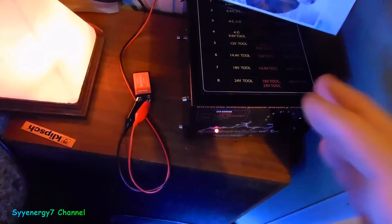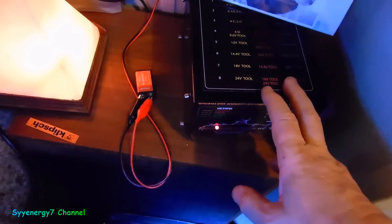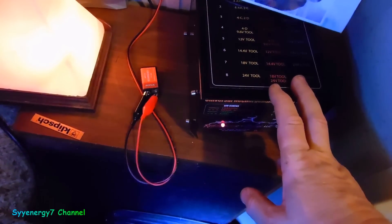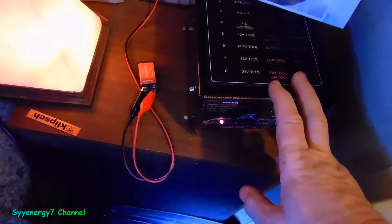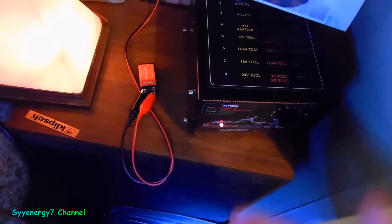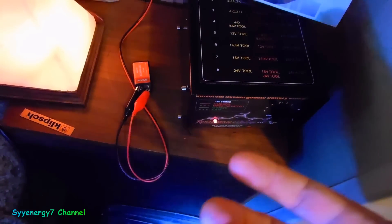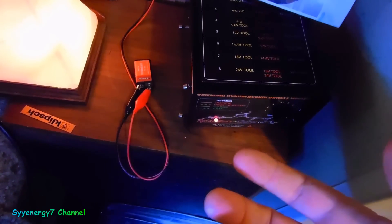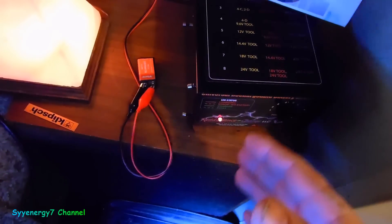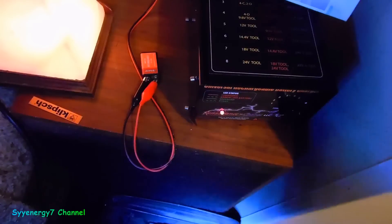If you see a battery that's got a shape like it's all curved like that and it doesn't have flat sides, that means something inside of it blew up — it just went poof. It's physically damaged. You're not going to restore a physically damaged battery. What the Bedini does, I'm pretty sure, is if the plates are severely sulfated and the chemical reaction's no longer going on, it can restore the chemical composition basically by getting the sulfation off the plates. It's a really high quality desulfator.